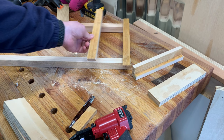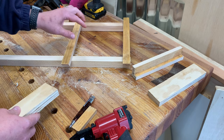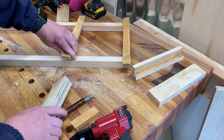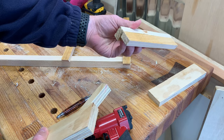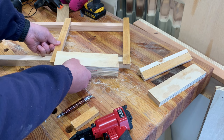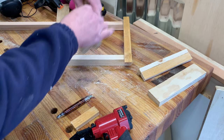Once you have all your uprights cut and all your 30-degree beveled pieces cut, you're going to need to make some kind of jig — something that helps you with repeatability. I want it to be consistent: how far down does it go — you decide — but you're going to be making six of these units and you want all six uniform. I'm just using some scrap plywood. For my purposes I have a one-inch piece and went with two and a quarter inches wide, and you determine how far you want it to go.